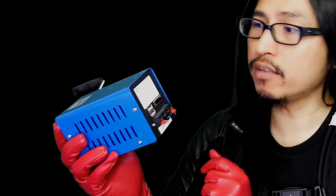We know that it's working, so you're going to have to crank this for 15-20 minutes to charge a low battery trying to start your car - this will work. My overall impression: I really like this device. Be careful - people who don't know how to use this might break their electronic devices. If you put it at 9 volts, 12 volts, or 15 volts to charge a small portable device or phone, it can destroy it. The website instructions telling you to shake the device - don't follow that. You don't shake it - you crank it. That's how you get power.